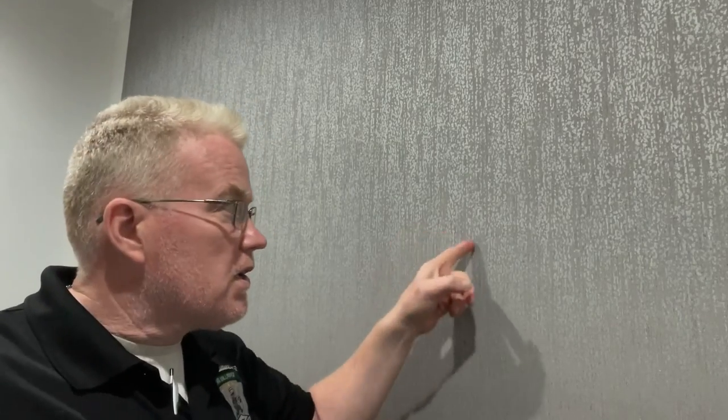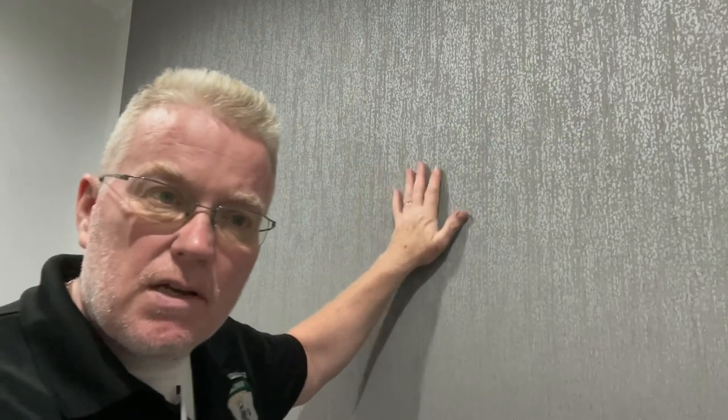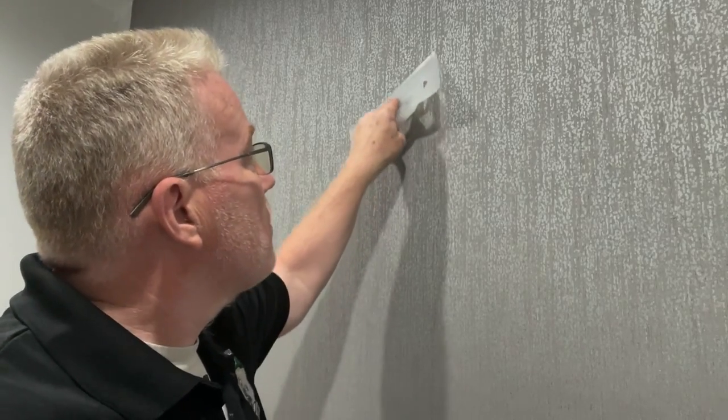Here's what I suggest if that happens to you: get yourself a scrub brush on a pole, dip it in warm water and just scrub the area so that you can get into these grooves. Those grooves trap water and paste. So if you happen to get water and paste stuck in those things, you may see the manifestations of that error when it's dry — it'll look like dripping wax, but thin. You scrape it off a glass — that's what it'll look like on your wall covering.